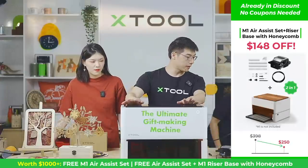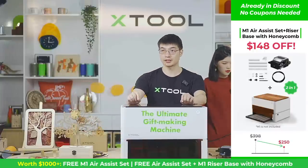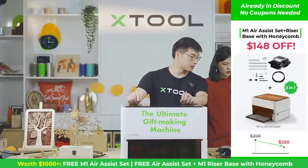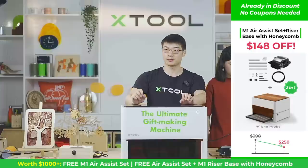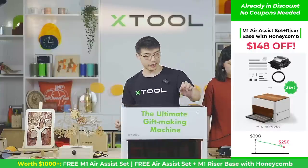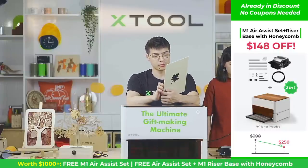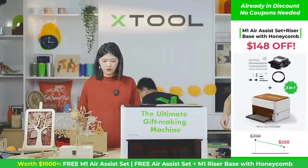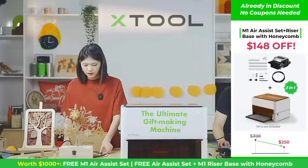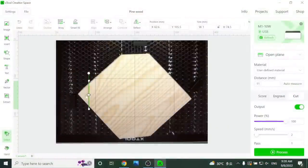The air assist is very useful when you want to cut thick material, because in this case you need to make the speed of the laser very slow. So we will use the parameter of 100% power and a speed of 2 millimeters per second. Actually, we spent a lot more time. When we cut the maple leaf, I think it was 3 millimeters per second. It's too slow, but we can make it faster. But for the thick wood, we use 2 millimeters per second, and we cut a line on the material just to test if this machine can cut through.